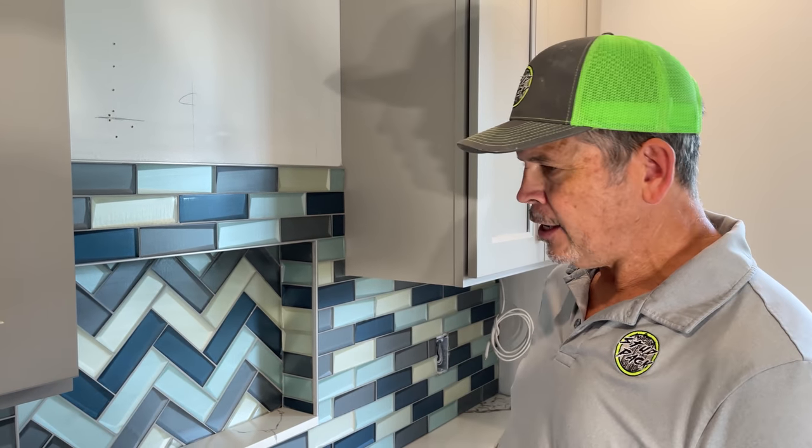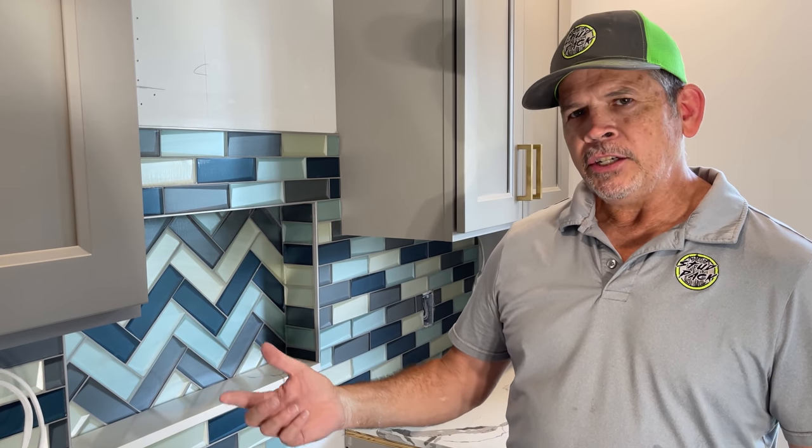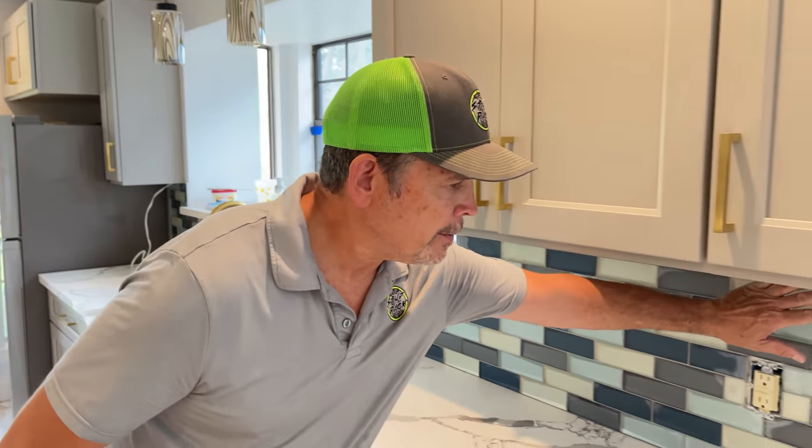I went ahead of Jordan with the small trowel, did these little edges. He came back with the larger one, did the broader areas. And then when I was done with my share, I went back and started cleaning. And we're always changing that water. We probably changed it 3 or 4 times at least. So we're always working with clean water as much as we can to reduce the amount of haze.